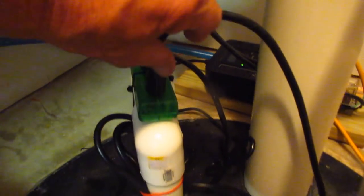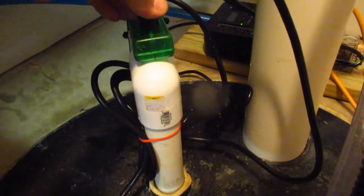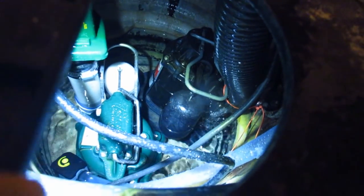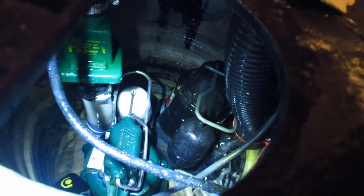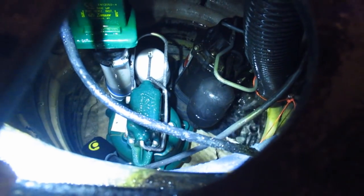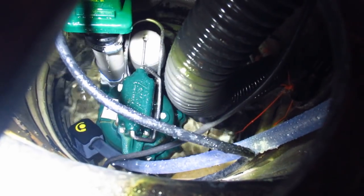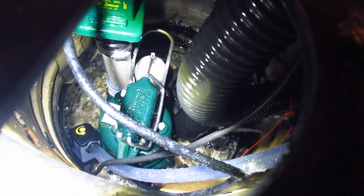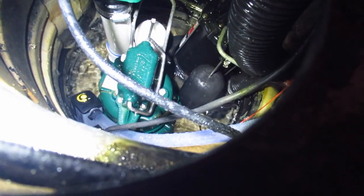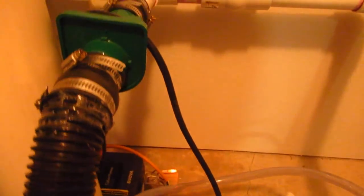Let's say the main pump fails — I'm going to go ahead and unplug it right now. This is the main pump. The backup pump is over there. You can see the water coming in, filling up the sump. That black pump is going to raise that lever. And there you go — that one shut off. So that's working good. It pumps it out this way, right here.